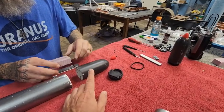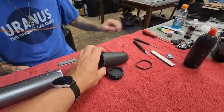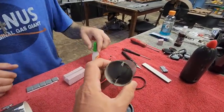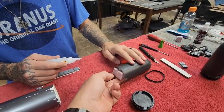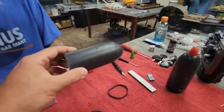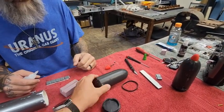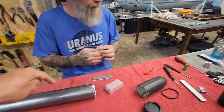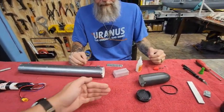Back to our nose cone. We're going to do this because it's a convenient place to put it. This is the top dead center of the weapon, which aligns with the fiberglass lip in there. The idea is foam goes high, and the weight goes in the keel down low. This provides a lot of stability because the foam is trying to pull up and the weight is trying to pull down, creating a line that keeps the assembly vertical.